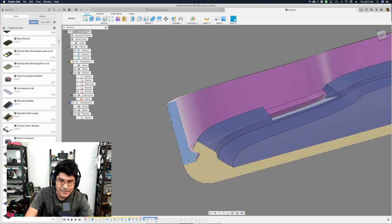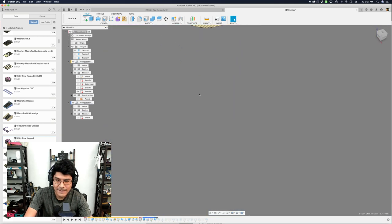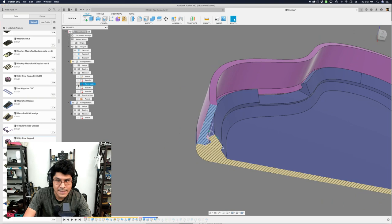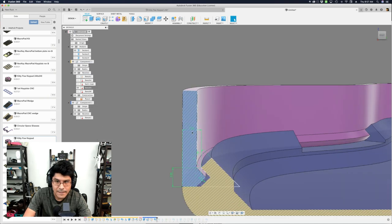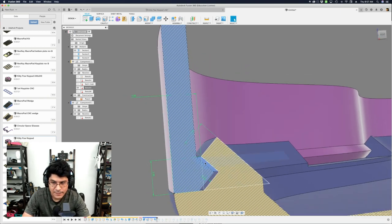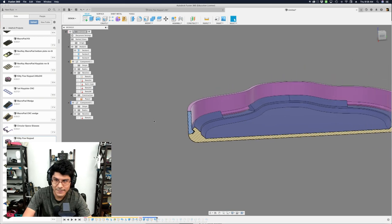This is kind of the back. So if I click on this surface and then rotate to this surface, it's 0.351, which is a little bit too much. So I'll bring up the snap again. I think it's this one. Right click, show dimension. And change that to 1.8, like that. And then we can see that this surface and this surface are 0.209 millimeters away from each other. And that's pretty good, that worked out pretty good there.